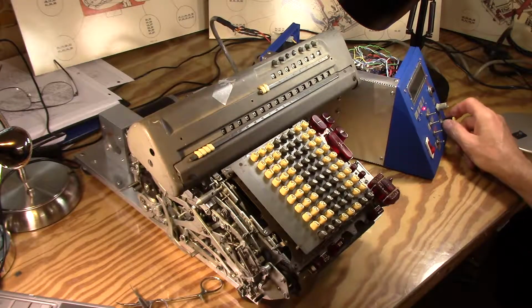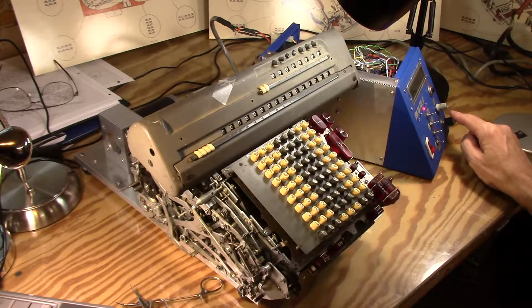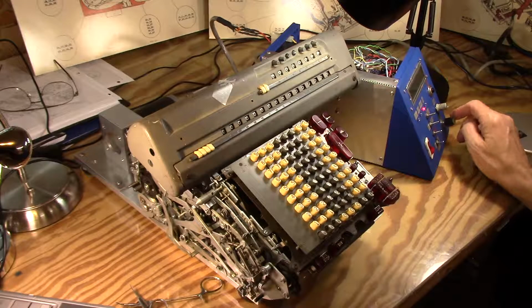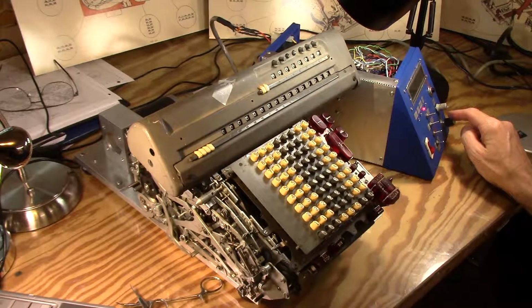The other thing I can do is adjust this potentiometer. Actually I guess it's just a variable resistor. It isn't a potentiometer. Well, whatever. Right now I've got it set for maximum force counterclockwise, and it's going through a resistor in series to a current measuring pin, and you've got a table of various resistors that you can set it to for various currents that the motor would then be safely limited to, so you don't burn up your motor and so forth. And I can tweak that a little bit higher. I think I can get about another quarter of an amp for right now.